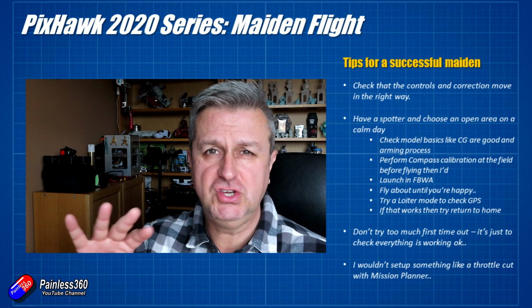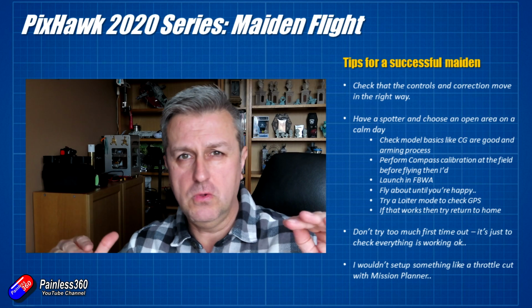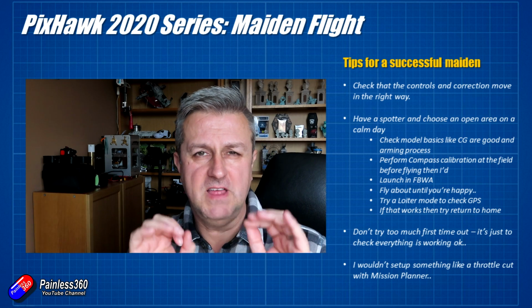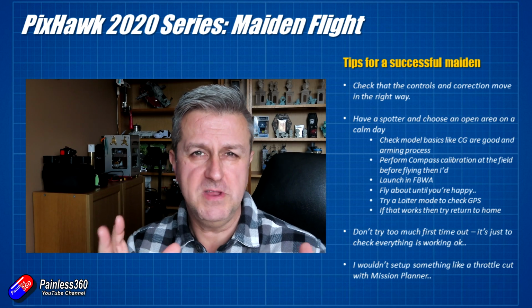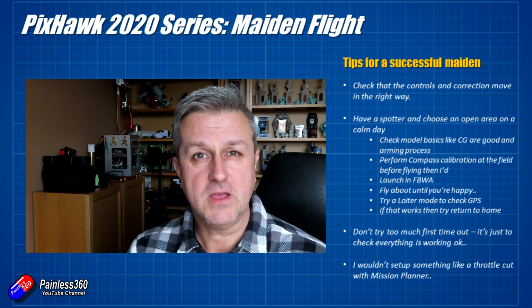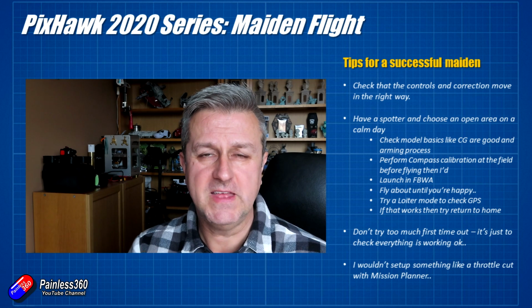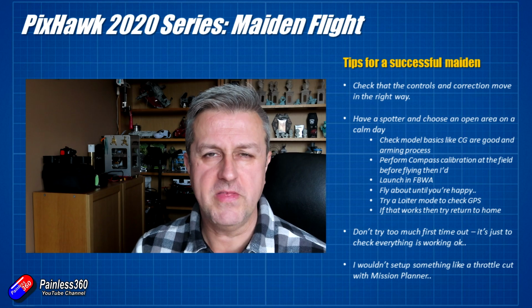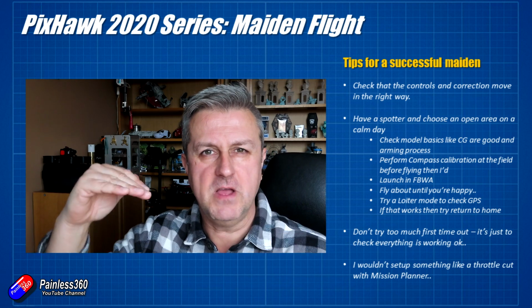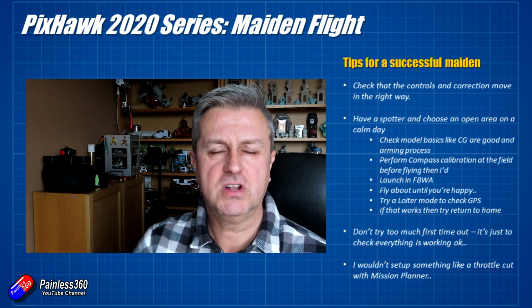Have a bit of a fly about, make sure that you're happy with fly-by-wire A and everything is performing as you'd expect. Check the limits of the roll and the pitch that you've got and make sure that everything is feeling good. Now it isn't tuned, so it's going to be pretty basic, and again I'll show you what it works like with this model with the basic tune, without me doing that. Once you're happy, I would then try a GPS loiter and it should circle around. Again, try and use a big open space with half decent weather. With a smaller plane, you might find that you have to increase the bank angle a little bit, but it should circle around the point.